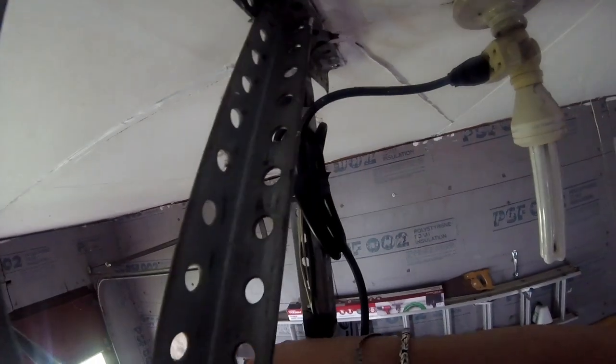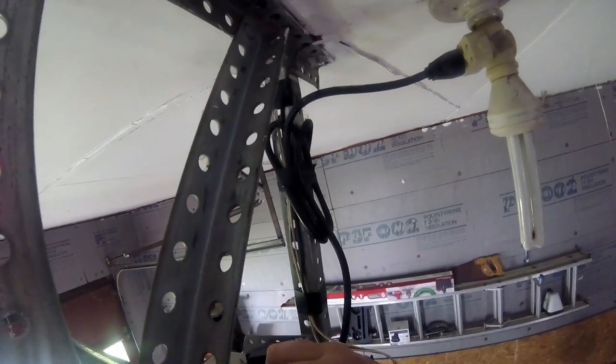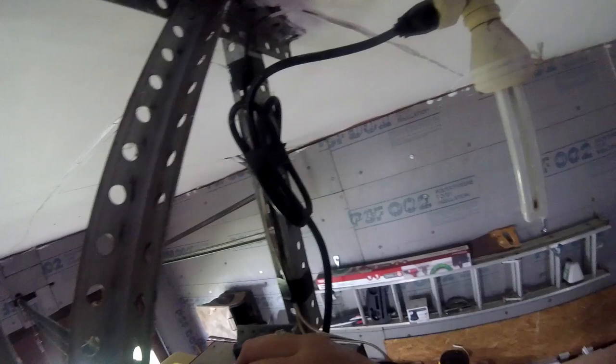Now, my vice grip trick didn't work. So, we're going to just see if we can muscle this chain on here, and try to pull it evenly over the sprocket. Hoping with a little bit of bounce, I may be able to get it without getting my fingers caught. Got it. Looks pretty even to me. Now we're going to go tighten that slack up in there.